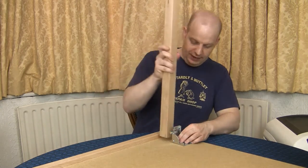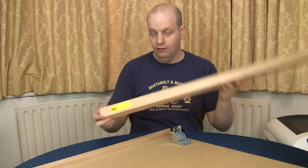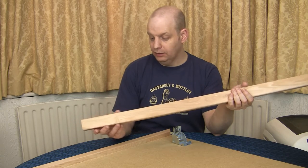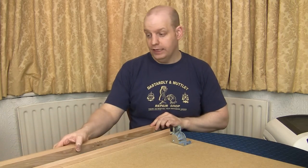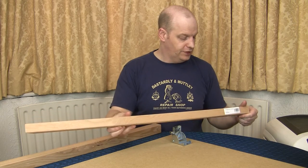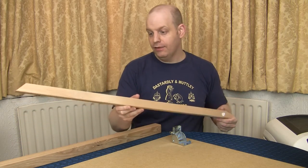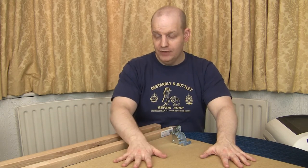This is how a leg would be affixed to the bottom of the table. This is a 41mm square hemlock staircase spindle — they're pre-cut to 900mm long, which is roughly the size I need for the table. These other pieces are 32mm squared and the same length, also from the same DIY store. The boards I'm going to be using are 12mm MDF.